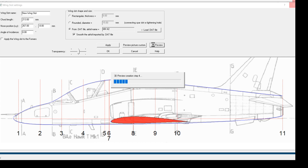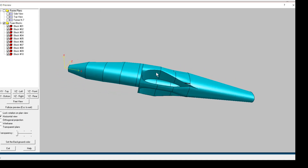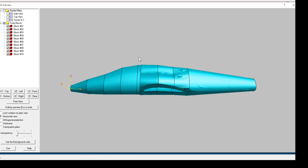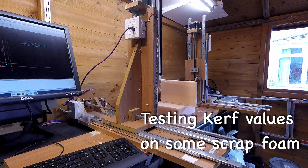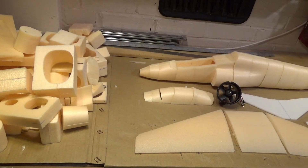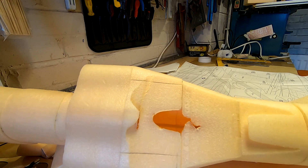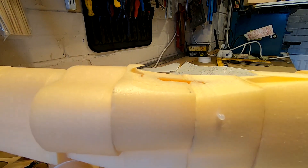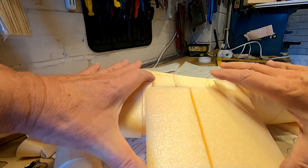Stefano came back to me and said it looked like it was the curve value. It seems that the curve value - which is the amount of foam melted away - works in the opposite way on the wing slot section. When you have a bigger curve value the actual slot comes out smaller. What I did in the end was try different values, and I put a value of zero for the curve and the slot came out the right size. I thought, even if it comes out a little bit bigger it's not going to matter too much because I'm going to be covering the wing in some sort of material and that will take up any excess. I initially thought I'd ruined three pieces, but I managed to set it back up again, re-cut it, and it's come out okay.